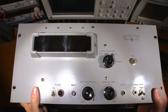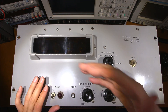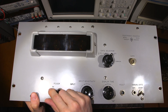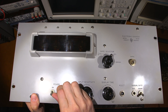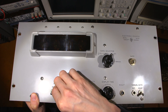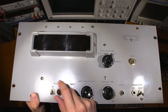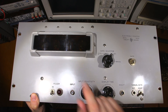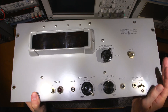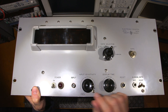Let's take a look at the functions on the face of this unit. It really is quite a big unit. We have an on and off switch right here and a power lamp — there's usually an incandescent bulb under there. Right beside this is the input jack, where we put the signal to make this thing display. We have input sensitivity, which is just a gain control — the higher you turn it up, the more sensitive it gets to the input signal.